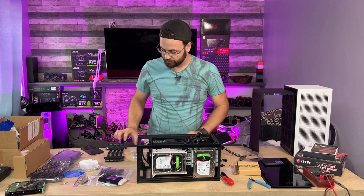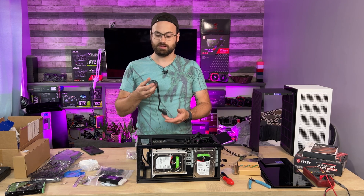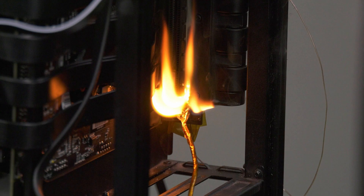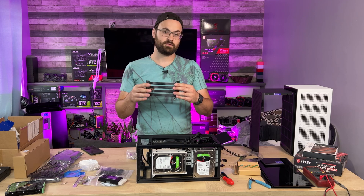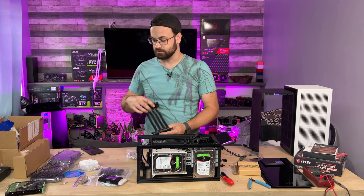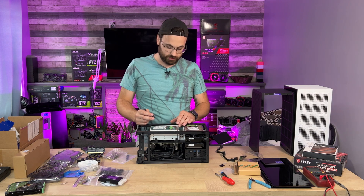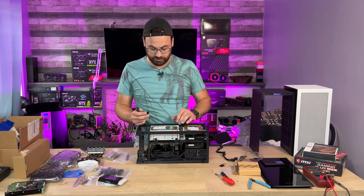I took the riser cable out — this is the version one that has the fault with the riser and screw holes where it can cause a short to ground and potentially cause a fire. It just didn't need to be in there. If you have the upgraded cable or the repair kit and want to leave it in, there is room. I'm sure you can see this bouncing a little bit; if I develop this further it would be addressed.